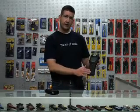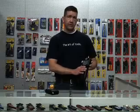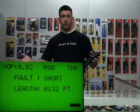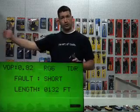It comes with three different features on it. It has a TDR, which is a time domain reflectometer, a wire mapper, and a sweep — all in this one compact unit. What a TDR is going to do for you is something as simple as checking how much wire is on the spool, or something more complicated — let's say you have a long run of wire that suddenly quit working and you don't know why. You could use the TDR to find out how far to the fault, whether it be an open or a short, with a lot of accuracy.